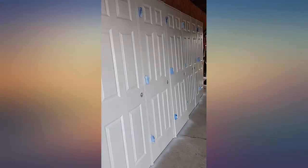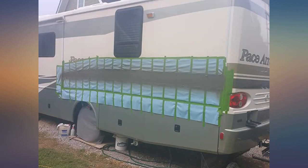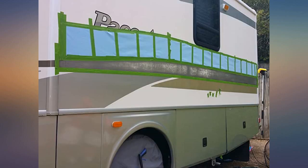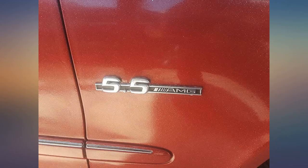I followed the exact instructions that Jake M puts in his review and it worked great for painting six pre-hung doors. It takes a while to get the right settings dialed in, but by the last two coats I had a really smooth finish. My advice is to always work with at least one-third of the can full. Any less and you will get some splatter.